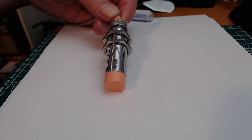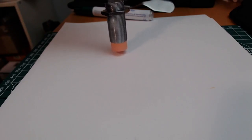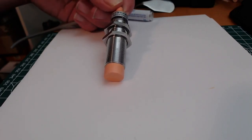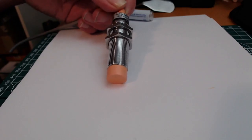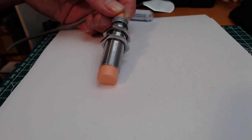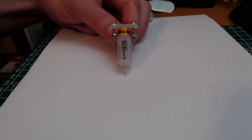This is the second sensor I will show you. It's a capacitive sensor which, as its name implies, reacts to changes in capacitance when it moves down to a surface. The good thing is that it will also work with glass sheets between the heat bed and the print surface and the nozzle. One thing which is problematic is that it's very large, needs a different voltage to work, and it's a little bit clumsy to get adjusted right.